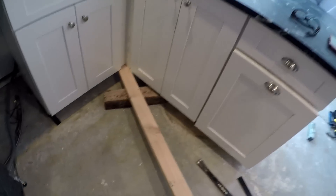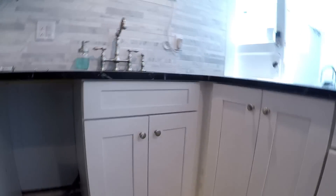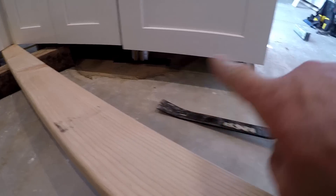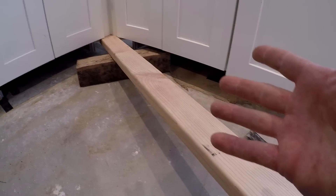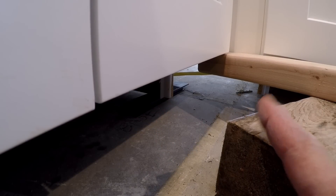I've got an eight-foot two-by-four and a block and I'm putting very slight pressure downward — just raising the cabinet enough to wiggle out that flooring. I've got all new shims going in: shims there, shims there, shims everywhere all along the back. I've got two more inside corners and this whole section will be done.